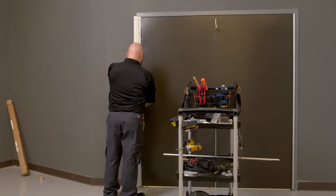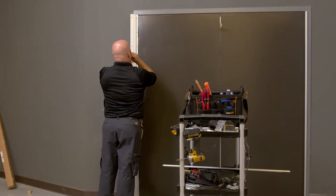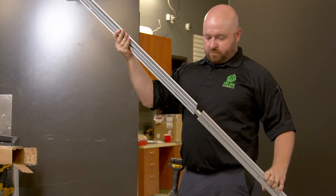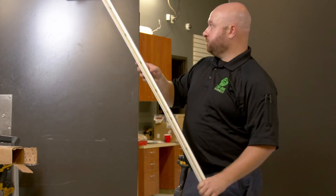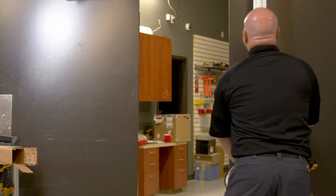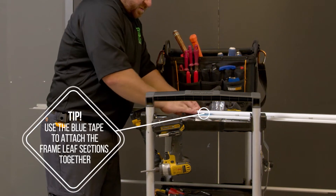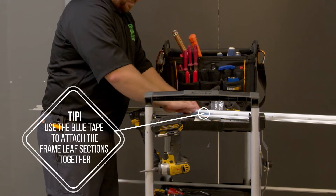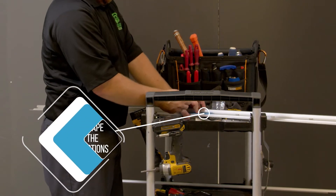We'll now position the frame leaf on the hinge on the face of the frame in the open position. You're going to fit all of the hinge sections together by sliding the extended hinge cap over the geared hinge. This will ensure the weight is evenly distributed. Here's a pro tip: use the blue tape provided with the fasteners to attach the frame leaf sections together. This will make it a little easier to install the leaf sections on the frame.